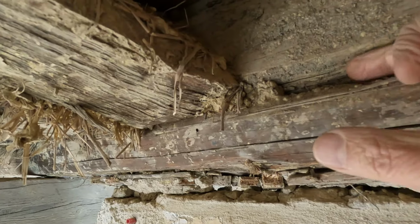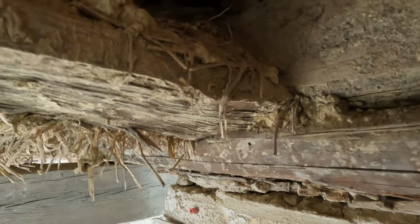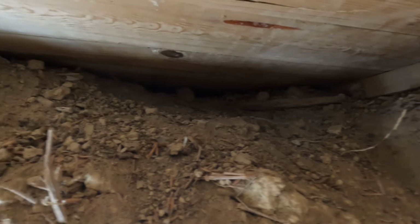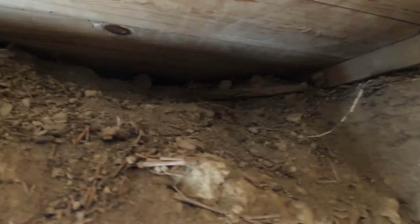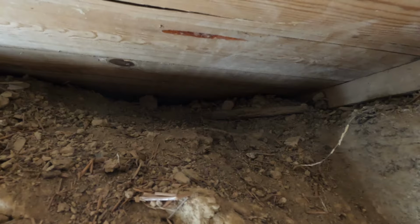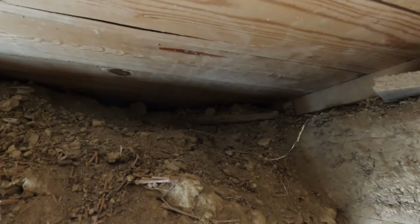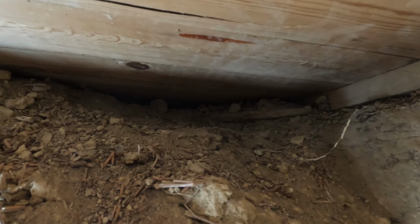But anyway, this channel is used so that boards have something as a support. And on top of those boards, the whole area, the whole room that they created was filled with clay and straw, as they did in those times. This helped preserve the wood. Clay is very good at that. And also, because it's quite massive, it greatly reduces noise coming from above. So if you're living downstairs, you hardly hear the people walking around upstairs. And we tested that, and it makes a huge difference. That's something to have in mind when we decide what to do ourselves.